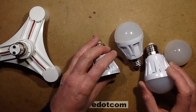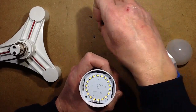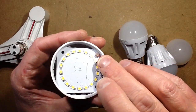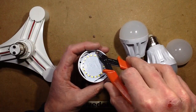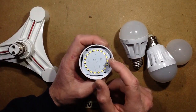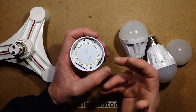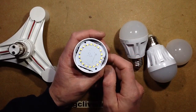I knew that was going to happen, so I cut out the LDRs. This is a handy little trick: when you open up you'll see there are little pads and the LDR will just sit in a corner, pretty much like that. All you have to do is get your snips and just gently go in and cut it out — with the power off, with the lamp unplugged. This has a couple of advantages: in this case it means the lamp will just operate 24/7. It won't sense light at all. As far as it's concerned, now the LDR's gone, it's very very dark and it's going to light every time it senses movement.